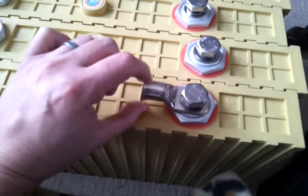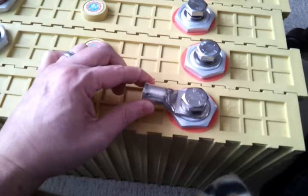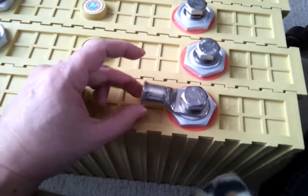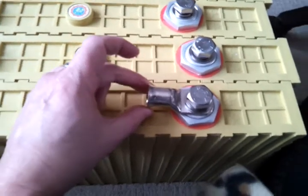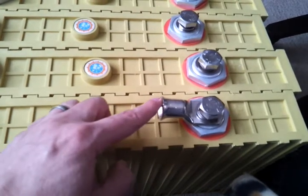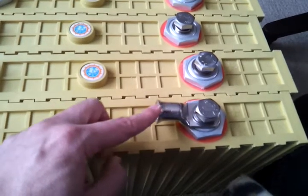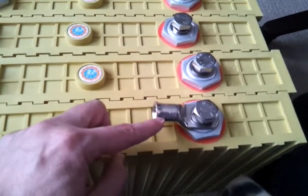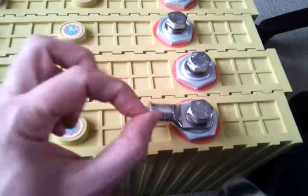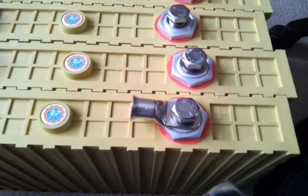I don't have anything that big, so I'll part-fill the lug with my 35 square millimeter cable and solder it in. They're designed as crimp lugs, but you need a crimp tool that costs about 200 pounds and can apply 12 tons of pressure to squash the thing flat. So I'll resort to soldering — it might work with my 100-watt soldering iron, or I might have to resort to a blowtorch. I've got my plumber's 200-watt pipe welder that might work.